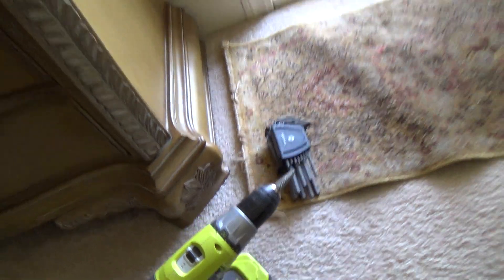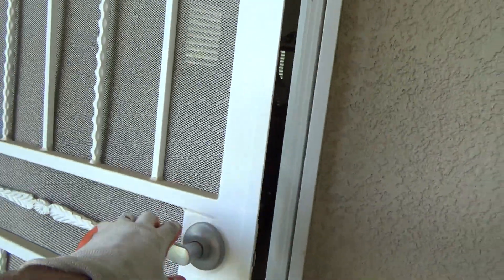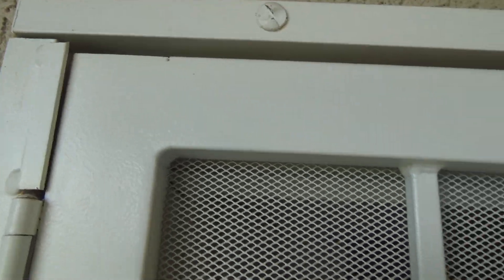I'm at mother's house still working on a to-do list. I've got an exterior screen door — a nice door system somebody installed years ago for my parents. It's got the one-way screws so you can only tighten it, you can't loosen it — the screwdriver falls right off. This door is slightly sagged down just a hair, not very much. You can hardly even tell, but up at the top you should have a bigger gap on the right-hand side than you do the left-hand side.